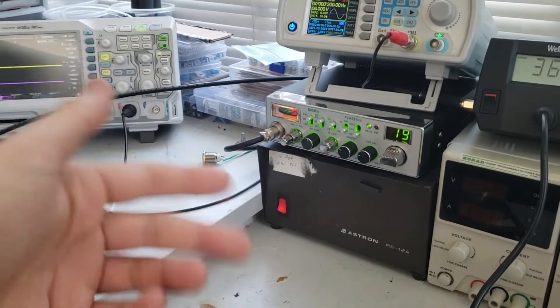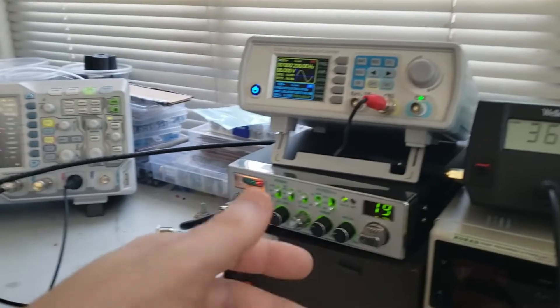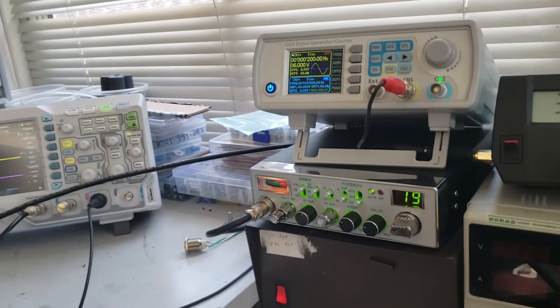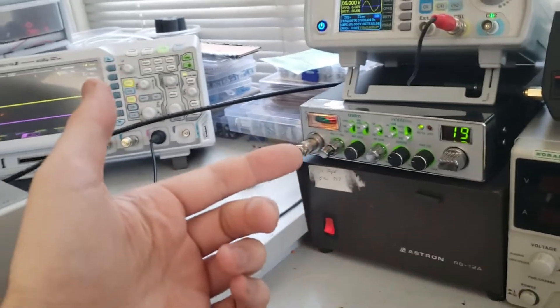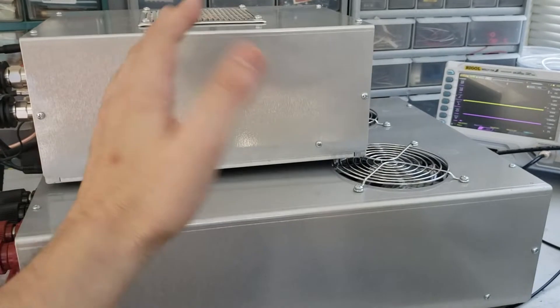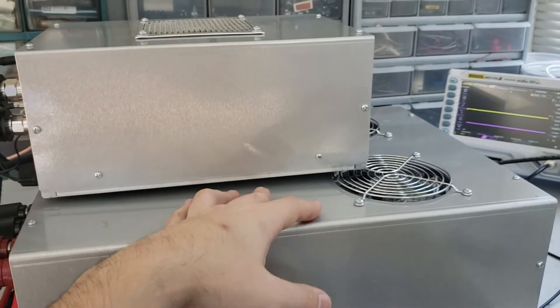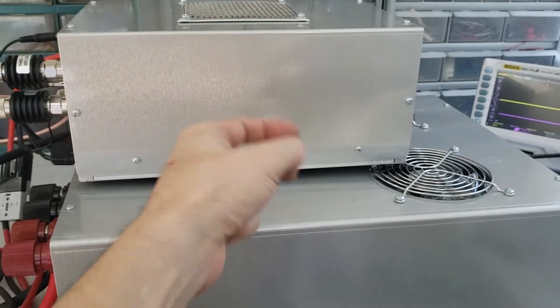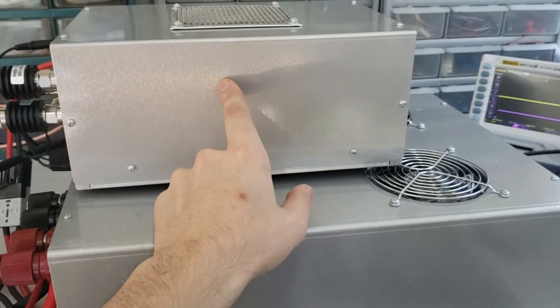I made a keying circuit that delays your radio 50 milliseconds before the amp turns on, and with all the other circuitry inside the radio it actually ends up being about 100 to 125 milliseconds. So when you key down on this radio, it activates your amplifier and in this case the power supply about 100 milliseconds before it actually starts transmitting RF. If you saw BVI's recent video — which was cool to see visualized — if you hotkey, your contacts just sit there and spark. That's why I originally had it hooked up that way, and that little time delay also gives the power supply the short amount of time it needs to boost up the voltage before the amplifier starts drawing power.